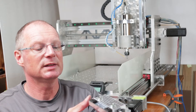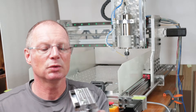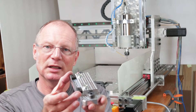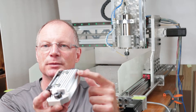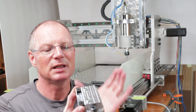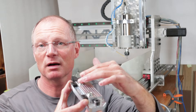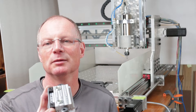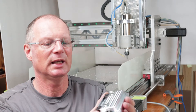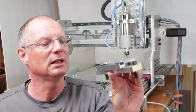The next feature is that I opted to use cap head screws in the fixed side, so that the fixed side top plate can move forward and backward. Therefore, I can rest it against the back latch. With a tapered screw, you cannot do that. The tapered screw head will always align the top plate where the threads are. It cannot be aligned in the thread and on the back — you can have either or, but not both at the same time. In German we say over-determined; in English we say it's over-constrained. These are the two main features of my version of the low-profile vise.